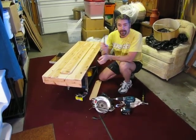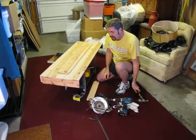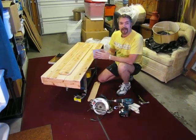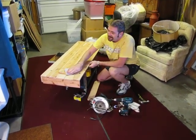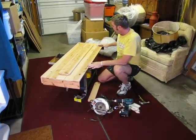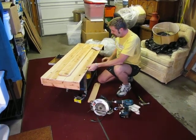You'll also need a drill bit to be able to go through your lumber as well, and of course a hammer. After you're finished with distressing your material, get a coarse sandpaper and lightly sand the corners everywhere around, so that you can run your hands over it without getting any type of splinters.